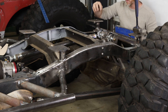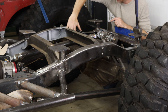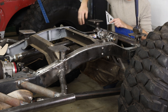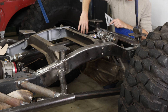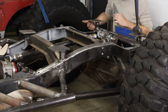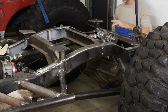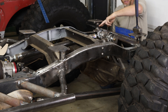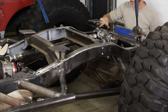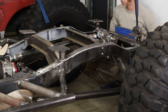Anytime you just have a joint that goes right down into a plate — the reason I bring that up is because these frame tie-ins, I'm going to box this frame in back here all the way down, but I'm going to incorporate this plate into this tube and underneath. We can get a bead underneath this tie-in plate, and then we're also going to do the same thing running down the length of the back. That way we have shear side to side and front to back, so these mounting plates will have shear value in both directions.